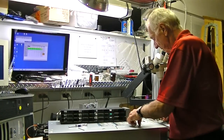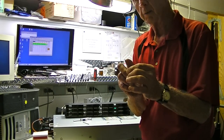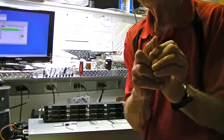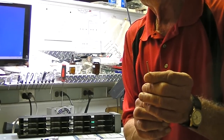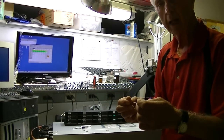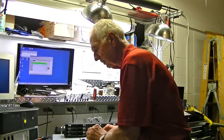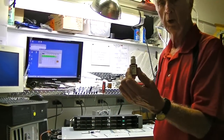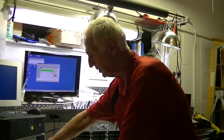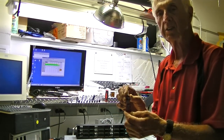With those in there, it actually worked. What the manufacturer did is they put a little bit of blue Loctite on here, and the blue Loctite is a medium-strength Loctite, and they only put it on one side — they didn't put it on both sides. It looks like how they did that is they first applied the blue Loctite, stuck the screw in, and then took the nut and tightened it down. The official Loctite is 242 — that's the number on it. It's a medium-strength Loctite, so you actually can remove it. It comes in a red container even though it's blue Loctite.